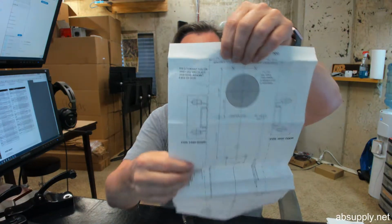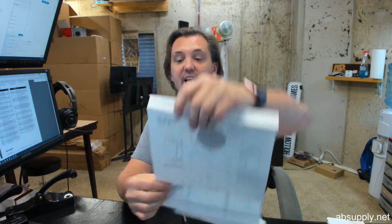it's 2 3/4 backset. And what they're really saying is they've got a 2 3/16 dimension here. If you were to take that template, close the door, take the template and fold it along that line, it'll be from the stop to the center of the hole. It'd be 2 3/16. However, the door is hanging over probably a 1/2 inch. And that's where you're going to get into that 2 3/4 inch dimension sort of area. So that'll work just fine, 2 3/4 inch,